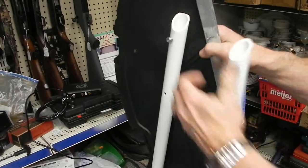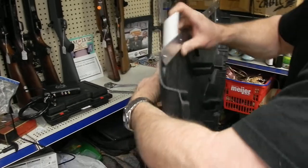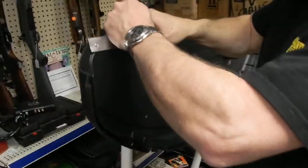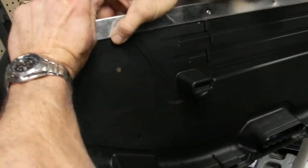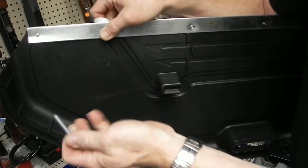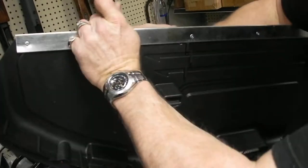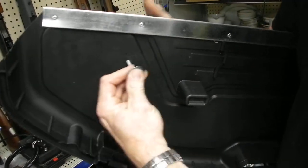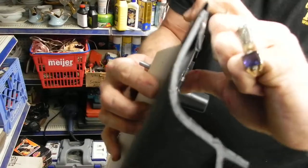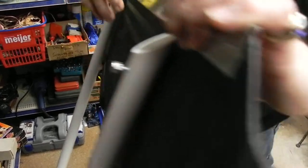Now do not tighten it beyond finger tight because you want to line all these holes up first. So now we've got that one — we come over to this one and I'm going to grab one of my bolts, a washer, and a locking nut. You kind of have to look down through here to get this to line up, but we're going to get it to line up. First, don't forget folks, you've got to put your washer on top. All these washers need to be on top of the blade. Now we push this through and you're going to see where the hole lines up — straight through just like that. Put your nut on the back. This is your locking nut. You got two of them in.